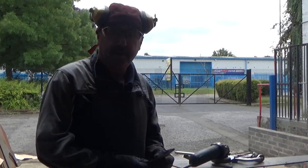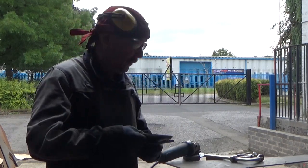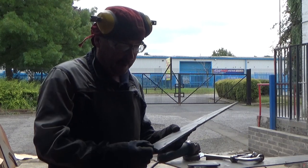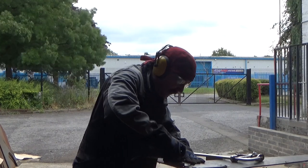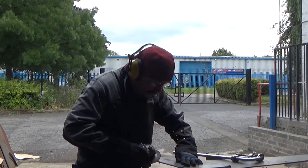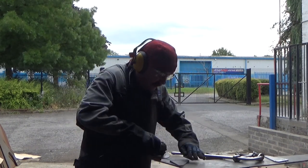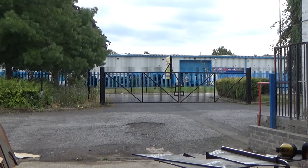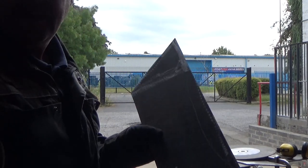That's that then. We've got the plates cut out. We've got two gussets in the middle of them, and then we've got two end plates, so we'll get them fettled up and get this mill scale off, and they can be welded up then. I forgot one job, haven't I? I've not done the radius round here, so we're going to mark that out and cut that out.